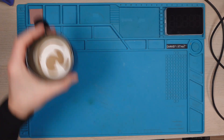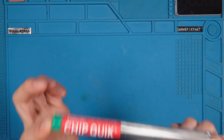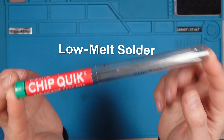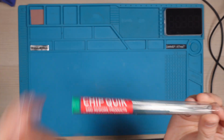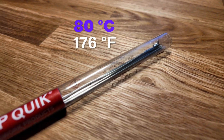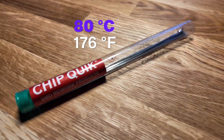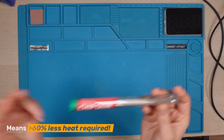But now you might ask: what can we use instead? I'm glad you asked. We'll use this - low melt solder, and it's a game changer. But there's one issue you could face, and more on that later. This insane alloy has a melting point of around 80 degrees C - an improvement of more than 60% compared to regular solder wire.